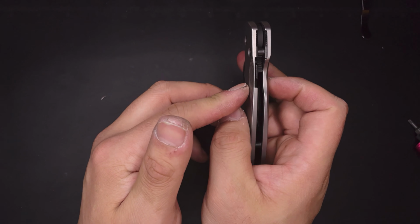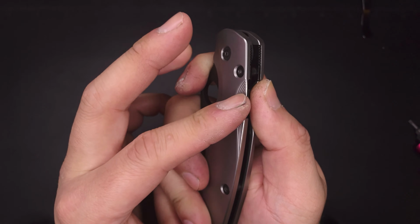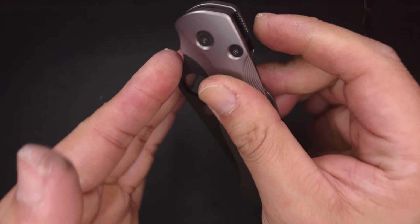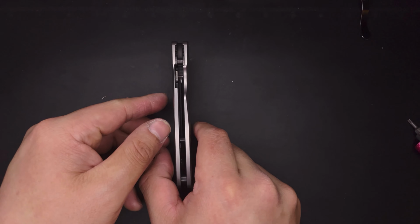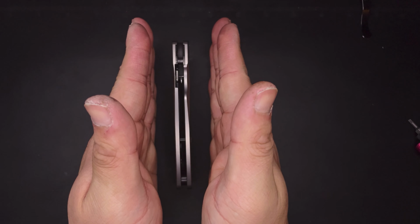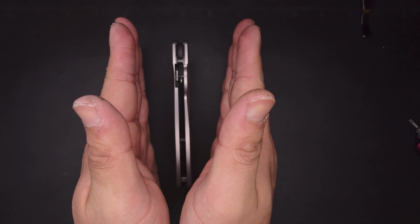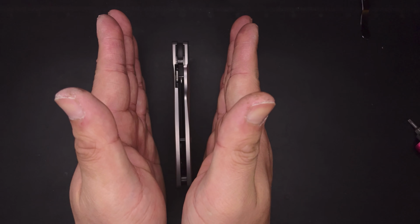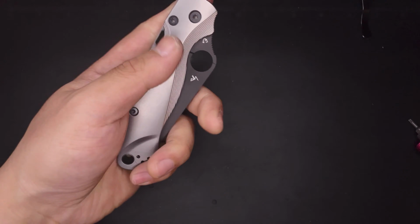So when you're at this position where you're going back and forth between making adjustments to the stop pin and pivot, and you're not really getting anywhere, that's a good indication that you need to go to the back screws, the body screws, again. Last time we tightened these, so that made the gap a little bit wider. So let's go the opposite way. Let's loosen these and get a little bit more pinch in the front and see what happens.